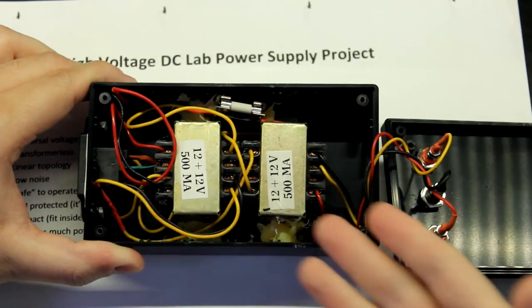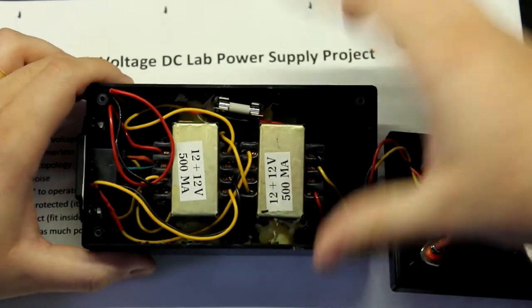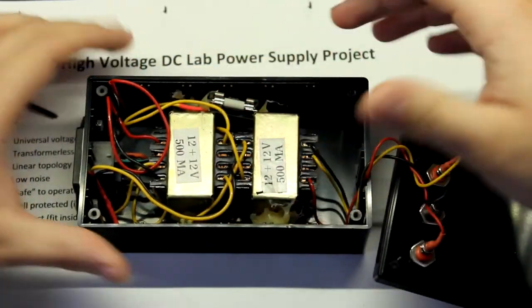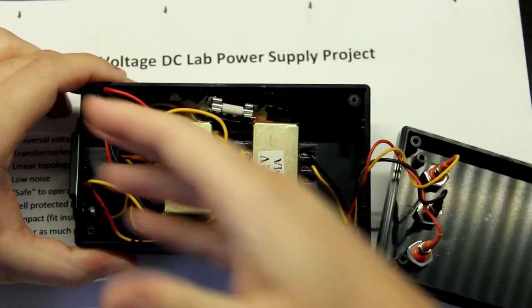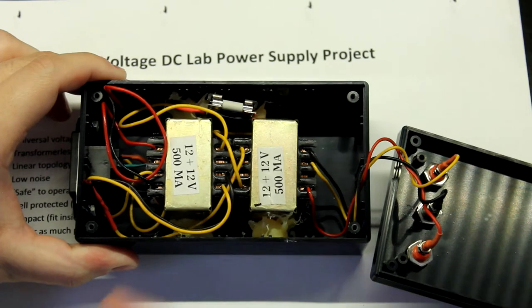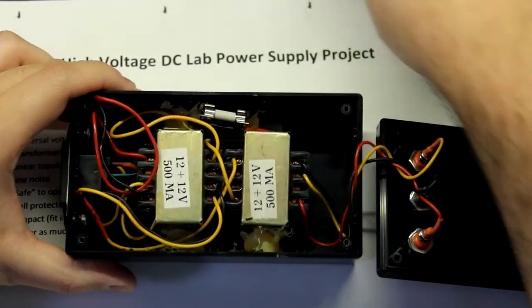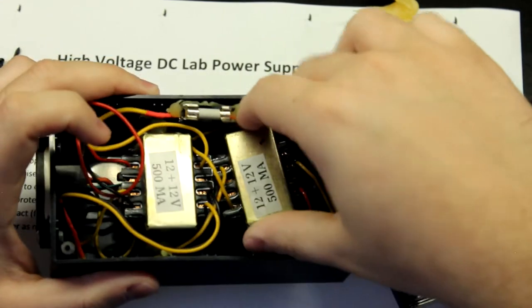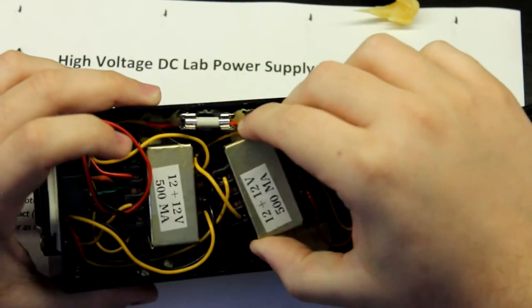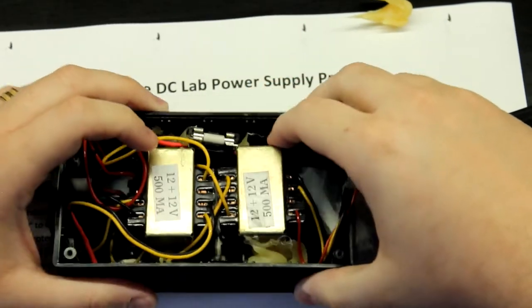Yeah, you can start with a piece of junk like this, okay? It's how everyone starts. Just so that you can have an idea, you can build an isolation transformer. It's not magic, it's not something that's impossible. You just have two transformers back to back like this, and you get a low current isolation transformer pretty easily. And apparently I had a shortage of screws because there are no screws. Oh, the whole thing has just fallen apart already. Yeah, because I didn't screw these in. I just hot melted them in.